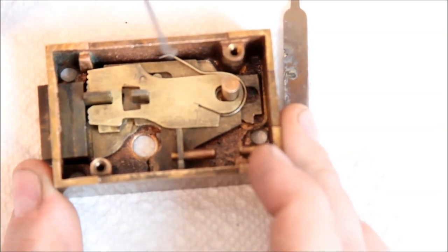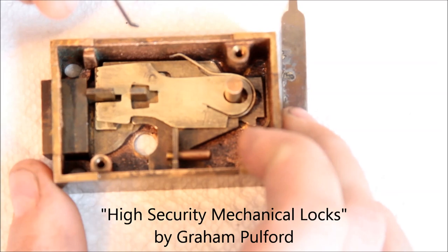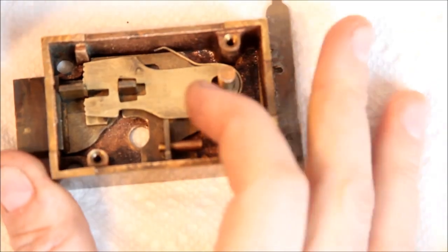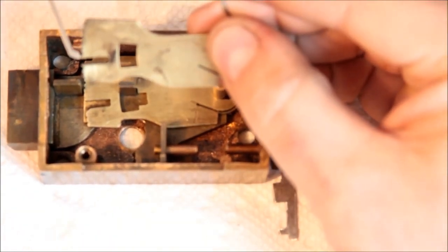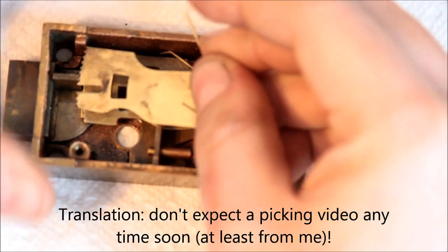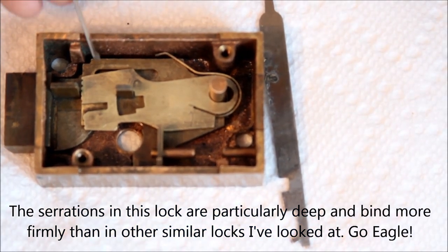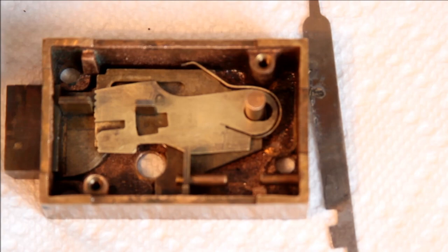Very cool lock — never seen anything like this with these sliding levers. It is not mentioned in Pulford, which doesn't necessarily mean anything, but probably because it wasn't very prevalent. It is novel. As for picking this lock — I've fiddled with it a little bit — any of these locks with a heavily serrated bolt is really, really hard to pick. Once these little teeth get locked up in here it's like two gears together; they don't move. You can press all you want and you're not going to move it, so you have to retract the bolt again and drop the levers. I'm sure it's possible to pick, but not easily.